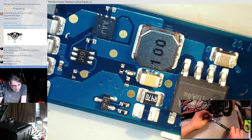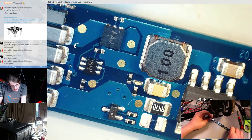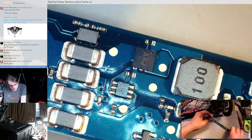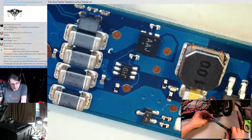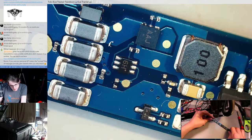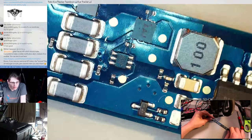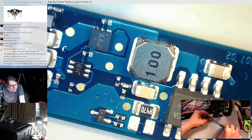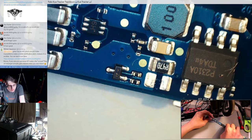And then over here, we're starting to see the power supply. I assume that... So I don't actually know what that 6H part is. That one labeled AAJ is definitely a switching controller. That 6H could be... It's hard to see where the other signals are going. But I'm assuming it's not something high power because all the traces going to it are small. It seems to be connected to the switching controller, so maybe it's some kind of reset controller. Maybe just some logic or something. Another small part, which could be a transistor or maybe some other random function.